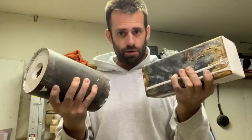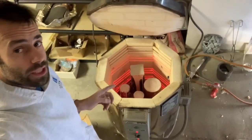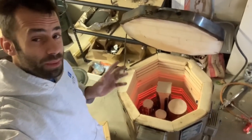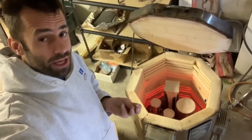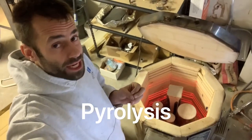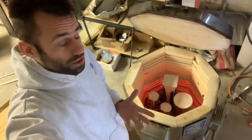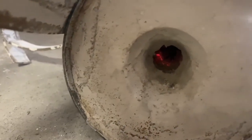I can't find my vent sprues at all. Once the organics are invested you just put them in the kiln and burn them out — how long, I have no idea. These pieces have been in the kiln overnight. They don't really look like they've done anything. One of the problems is that it's hard to get oxygen up to the material so it actually burns. It's a process called pyrolysis — the organic matter is breaking down but it's not actually combusting like it would with oxygen, so it takes longer. I took it out to check on it and you can see the pine cone is still burning in there — it's got a ways to go.